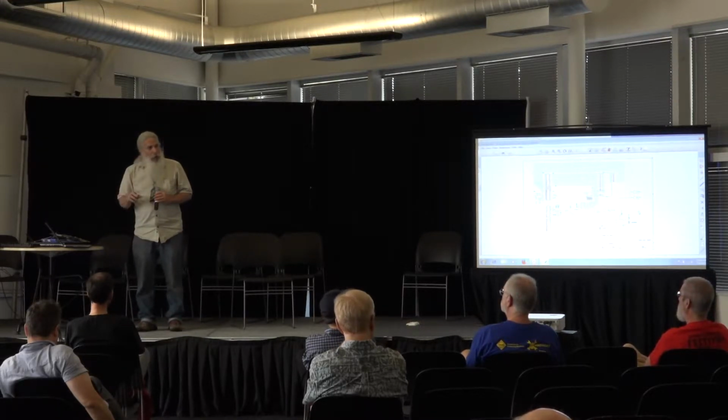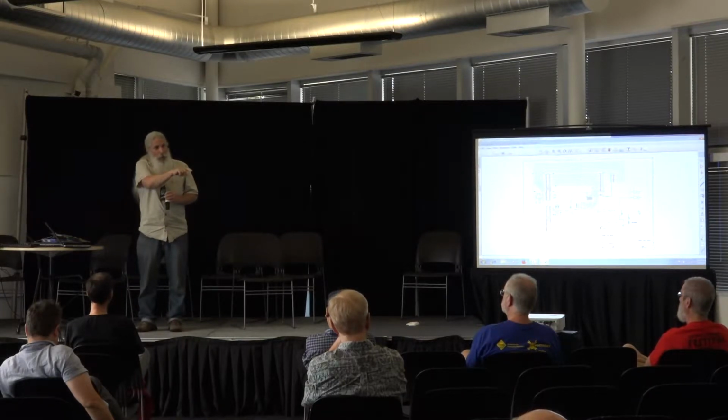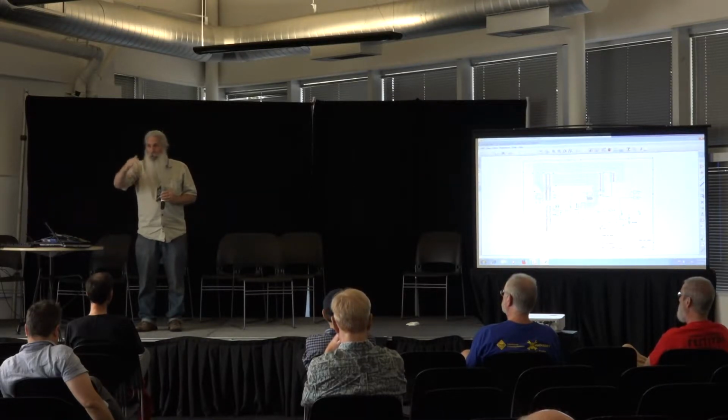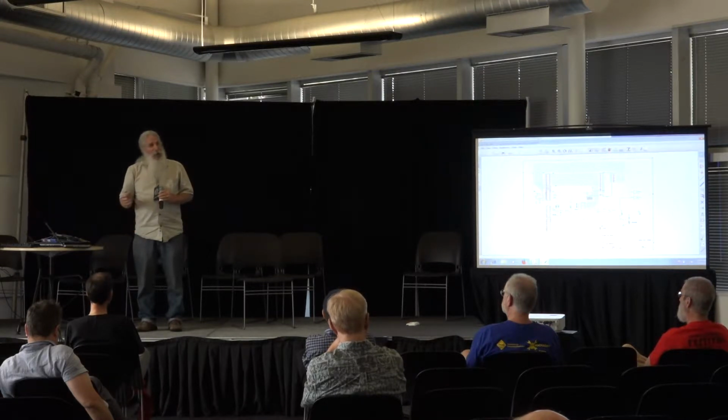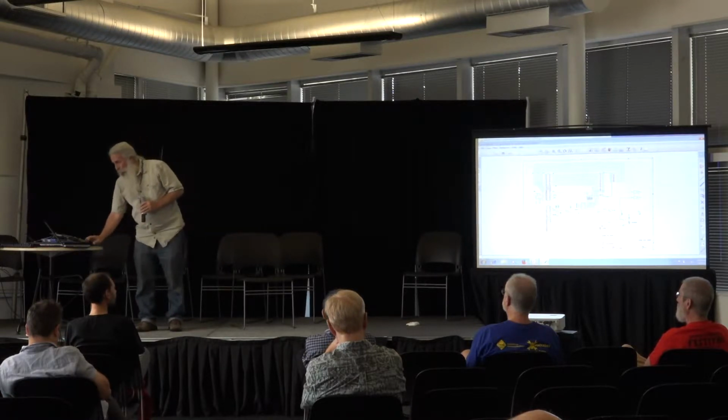The thing you have to understand though is when you're doing the layout of the board, when you tack a point down, all you're doing is tacking one dimension of that wire down, and as you drag the wire, you can still move it around. In other words, it's the last corner that you're actually tacking, and when you move the wire around, it shifts. It's kind of counterintuitive, but after you use it for a while, you realize that's how you really want it to work anyway. You want it to help you get your wires routed through the board.